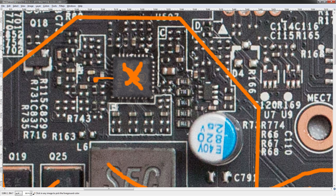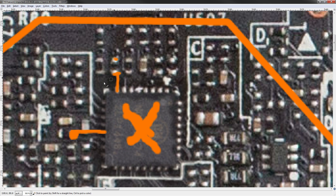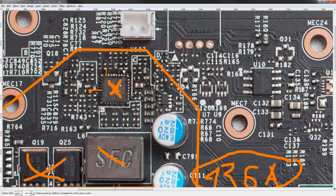We do have a current limiting pin right here, and it looks like there's actually no resistor installed there — it looks empty. Measure the resistance across it: if it's infinite, the card has no current limiter. If it isn't infinite, there is a limiter and you can remove it. Conversely, if it is infinite and you want to set a current limit, you can install your own limiting resistor there, though I've never really cared about putting limits on things — I'm more about removing them.